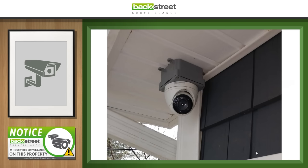They did everything right. The gray does match the siding, which is good, but it would have looked cleaner with the white mounting box made for this Pro 90D. A for effort and quality — the connections are protected from weather and tampering, and they did mount to the blank cover on the four-square, which is exactly what you should do. It's a really good install, it just would look prettier with the right mount. They also still need to take the plastic off the night vision system. Let's call that one a B.